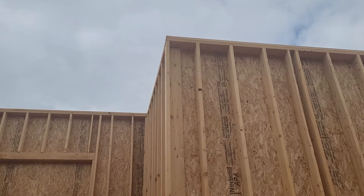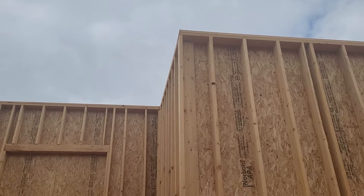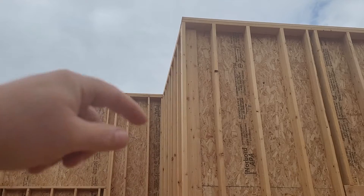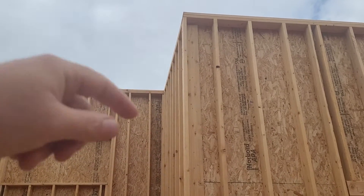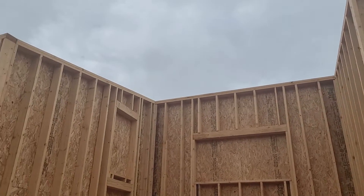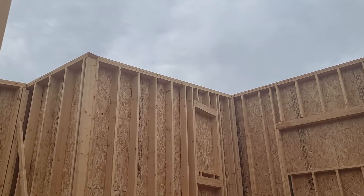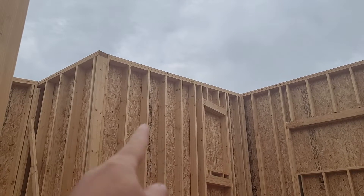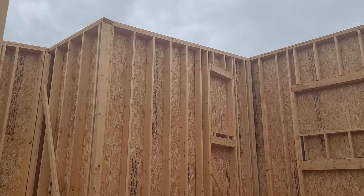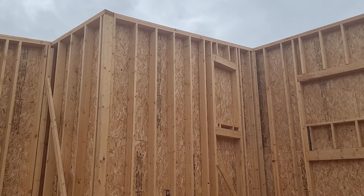I know I've talked about these beams in about three different videos, but this is the last time. We're going to have a 4x12 beam sitting up there, but I have to cut a little pocket out and re-support the bottom there for the beam to go across. That'll attach over there. I need to cut a small pocket and put supports in the bottom. I don't have the scaffold today so I'll be up on the extension ladder trying to get that done.